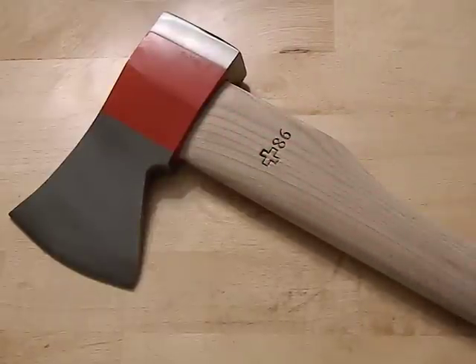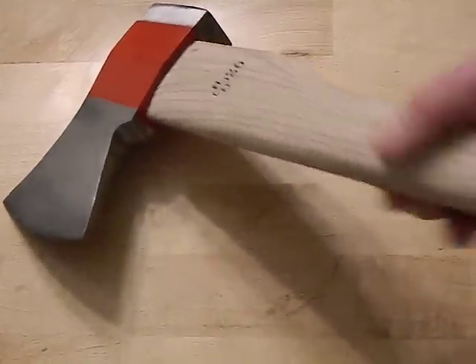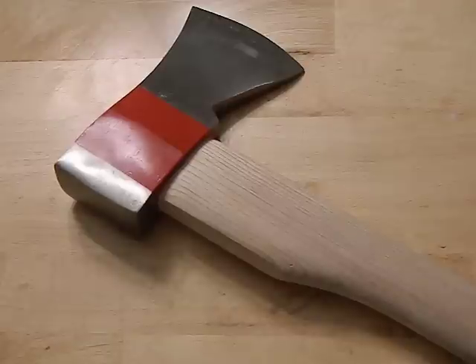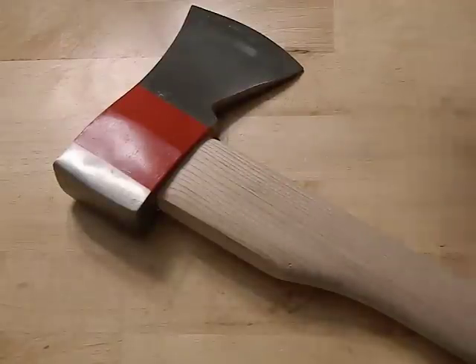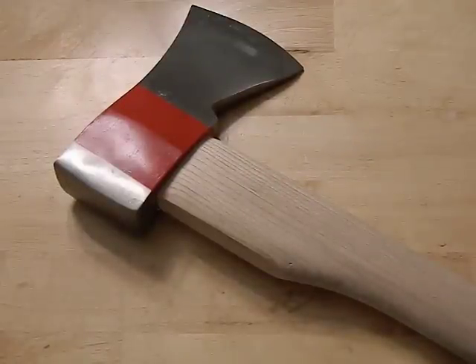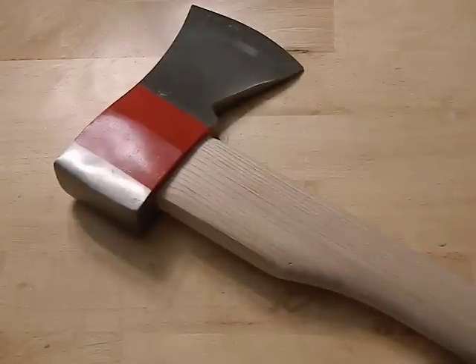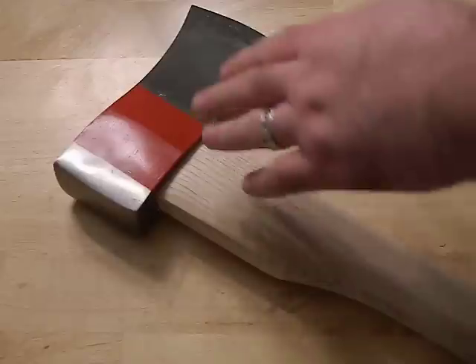There's pretty much no grain runoff — the grains are very straight. There's a little bit of runoff in one spot, but that's not going to affect anything because it's on the back of the head. The front area and the entire length of the handle, the grain is straight top to bottom. You can follow the grain lines all the way. That runoff is only because the handle is getting wider, not because it's twisted. So the grain on this is actually really good — it's got some really nice tight rings. The snobs out there are going to say the grain's wrong, but this thing's not going to shatter and it will be fine.